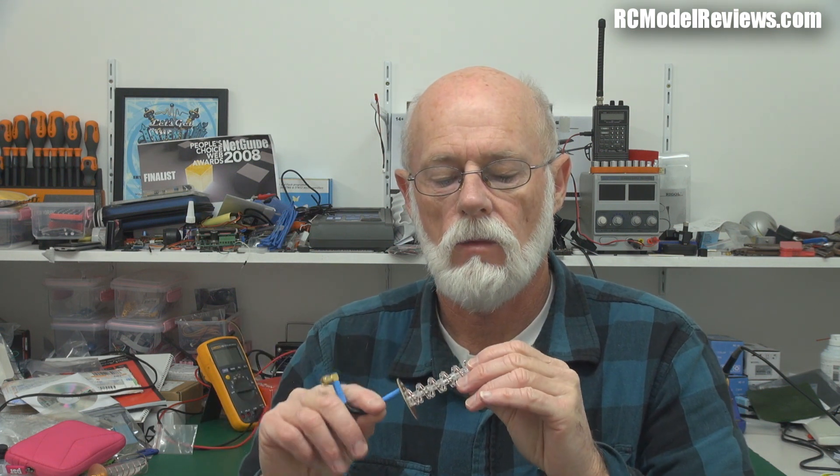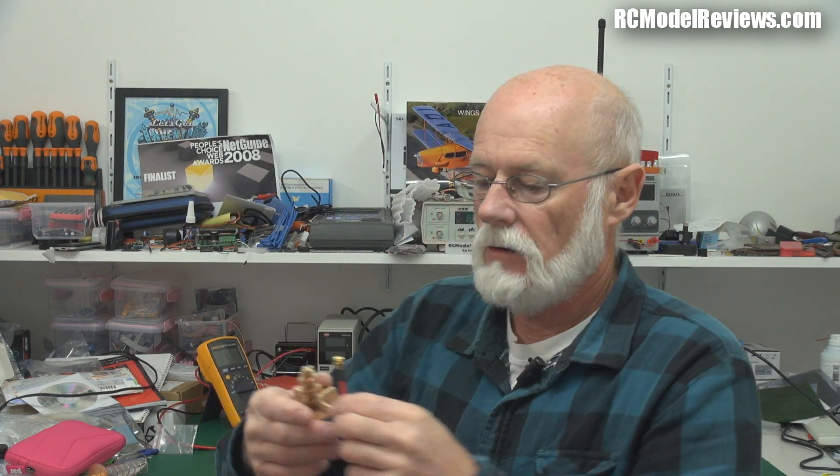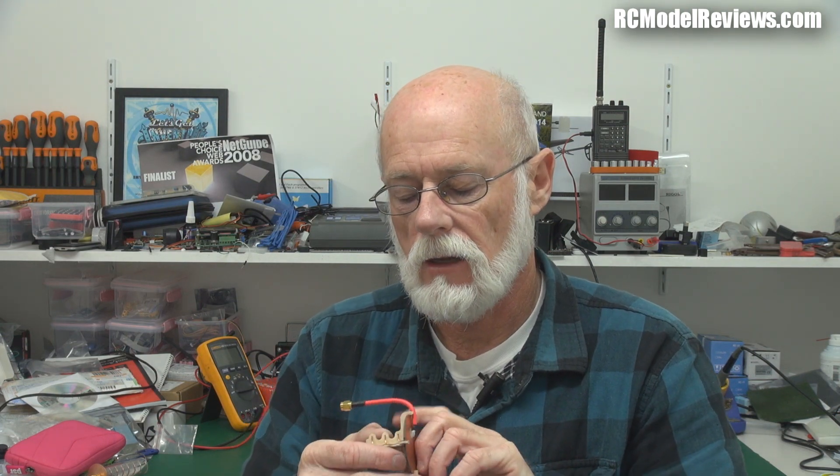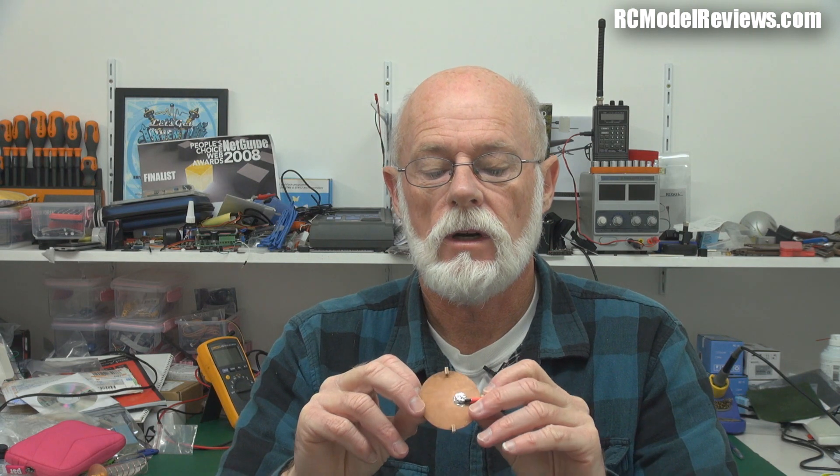This one has been made using a piece of fiberglass circuit board with an acrylic former. I'm not sure if that wire is enameled or not. Then we've got this one here made from CNC-cut plywood with a PCB base on the bottom. Again, I'm not sure if the wire is enameled. My concern with this one is that the wood will absorb moisture, especially in winter if it starts raining while you're flying.